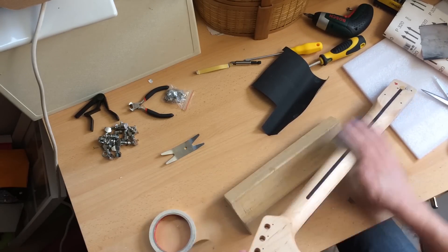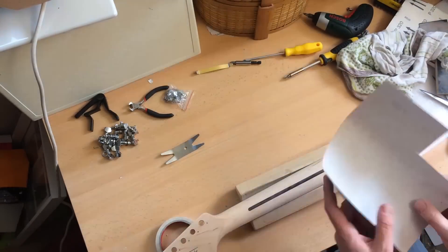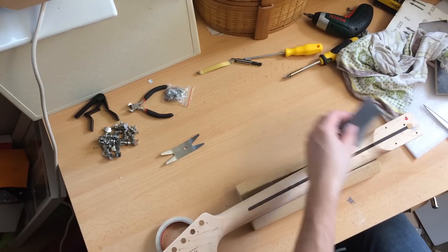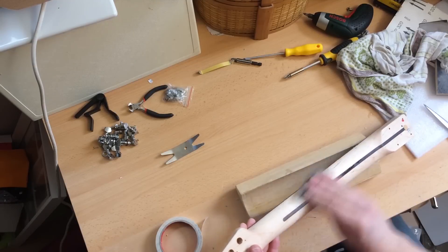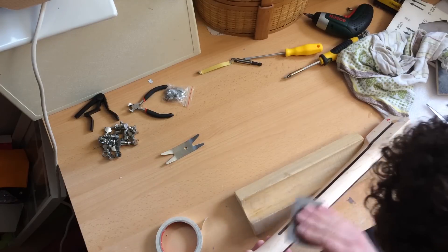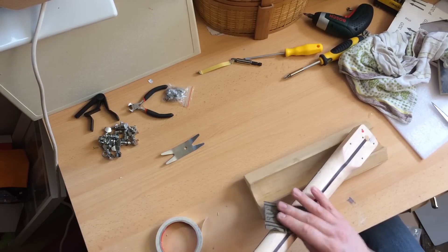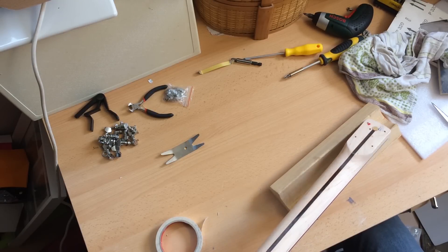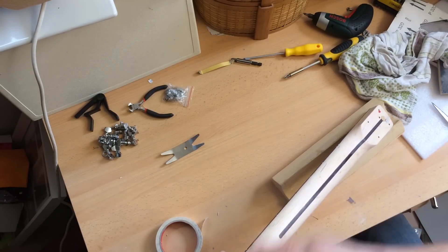Pressing a little bit harder with the 600. The 1000-grit sandpaper — wet and dry — we'll try wet. Not too much; I'm not going to be doing much with this. There's a blemish in the neck there that's really frustrating me, but you won't be able to see it when you're playing it and you won't be able to feel it, so let's not worry about it. This is really just taking off any edges, and as it's 1000 grit you can't do much damage.